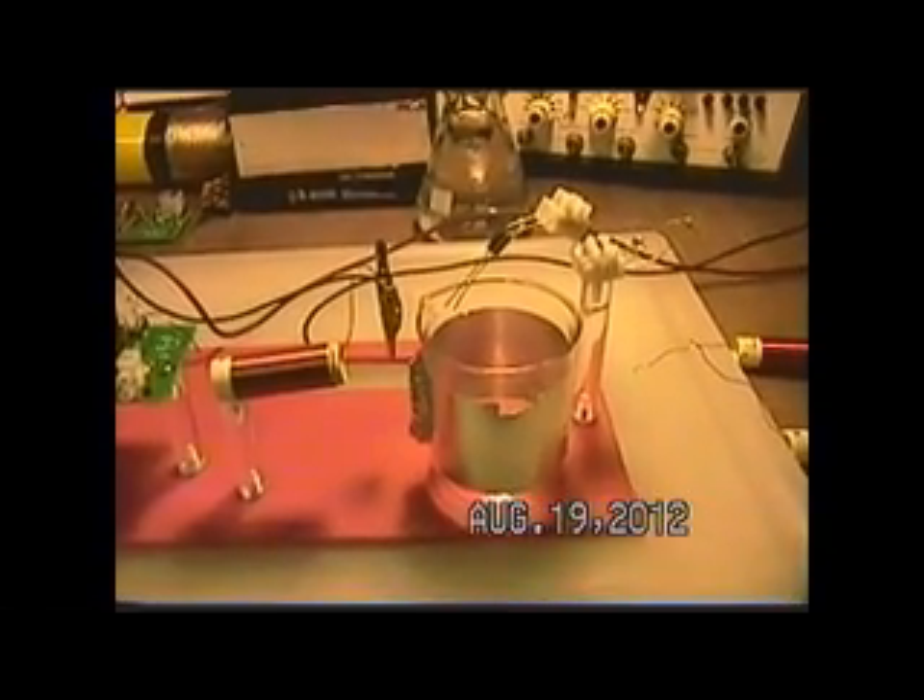Let me show you what the setup's going to be — I may do this in more than one video. I really get tired of sitting there for hours uploading these things. These are two ferrite beads of the same type that are used on the exciter circuit boards for filtering. I've hooked them into my terminal strip. Here we have two 1N4148s, and you can see they're hooked up opposite out to the ferrite beads.